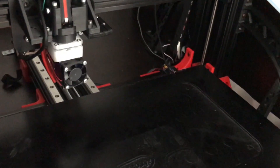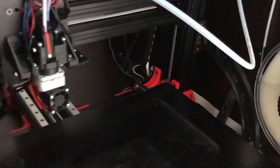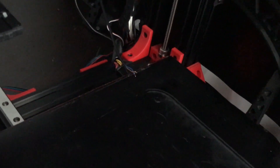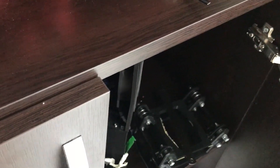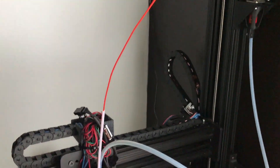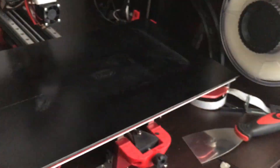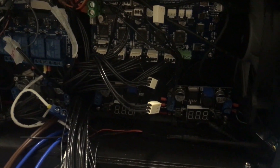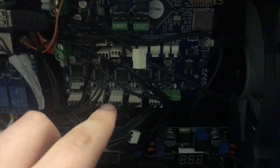So I'm going to replace that sensor. I tried to replace it with the Z end stop that I had, which I didn't use because I had the BL Touch when I received this printer. I replaced the end stop with that - a sensor I know works for sure - but it didn't work. Even though I didn't touch anything inside the control box, I reseated everything. It didn't help at all. Since I did move the Z axis up and down a bit, I thought maybe the cable inside the drag chain is bad, so I made another cable and tried with both sensors - they didn't work either. I've been eliminating everything I can, including the internal wiring.